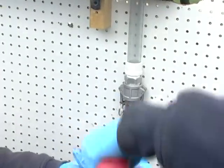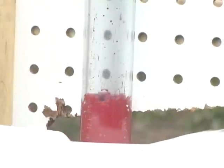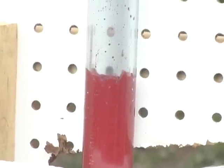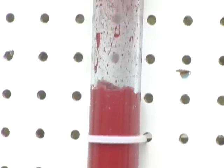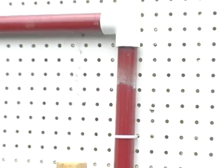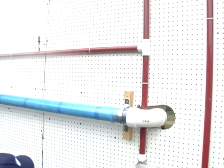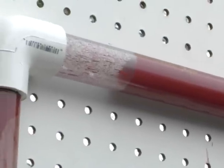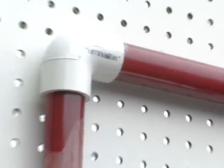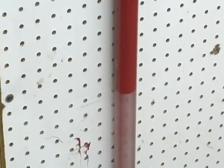By controlling the airflow, our technicians can push the coating away from gravitational pulls and around 90 degree bends, while choosing the direction of flow at each joint. Once the epoxy is introduced to the access point at the opposite ends of the pipe, the coating is complete, and the pipe is air cured. For epoxy of this type, minimum cure times can run about 8 hours depending on temperature, and most systems are usually left to cure overnight.